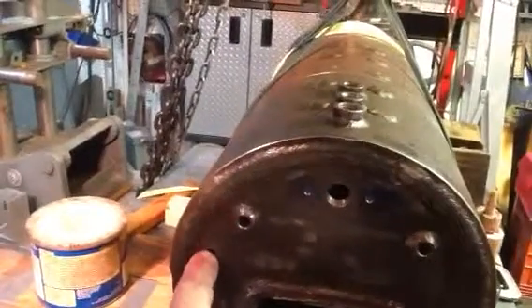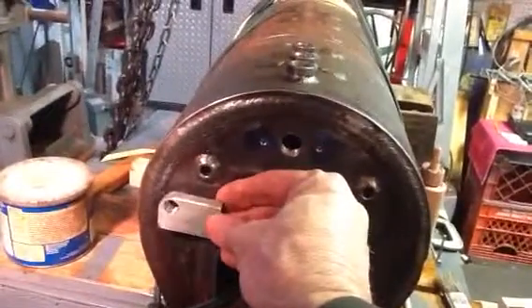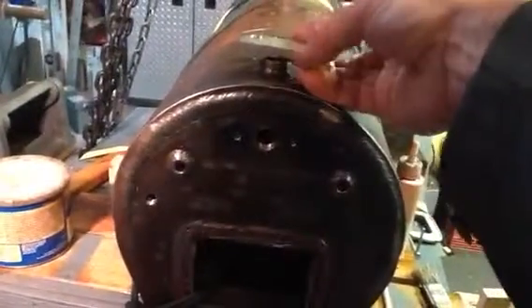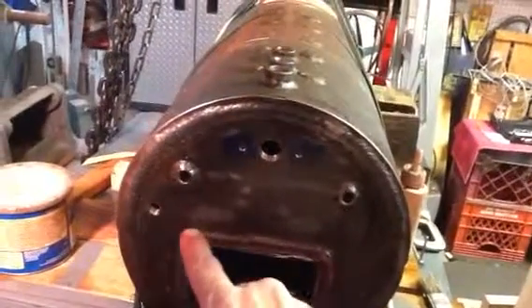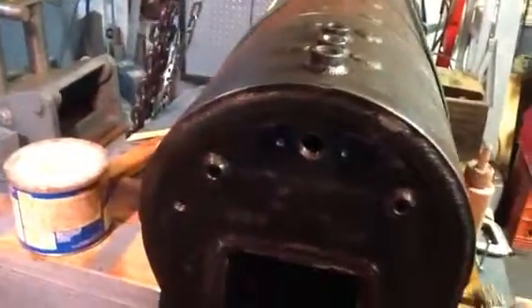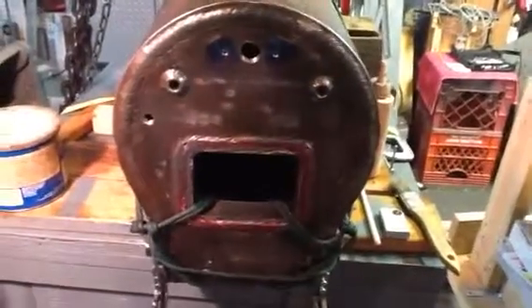I did make a little jig so that I could make sure to drill and tap squarely. Here's my little jig — I had it clamped in place over here, and you can see I relieved the back of it a little bit so it would clear the fire door welding. That's it for tonight. I appreciate y'all watching and hope everybody had a safe evening.